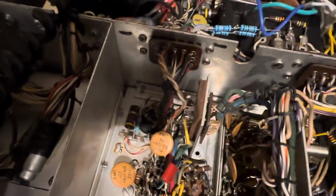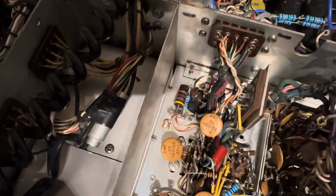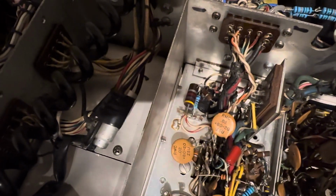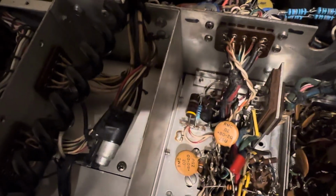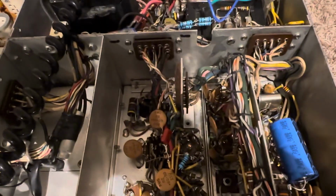When I go from 340 volts down to 302 volts, there's a small percentage difference. So I calculated that if I put a 33K resistor in parallel with the 4.7K, I'll get down to 4.1K, which is what I need. I didn't quite have any 33Ks, so I think I put a 47K in parallel, which brings it down somewhat, I think around 4.2K instead of 4.7K.